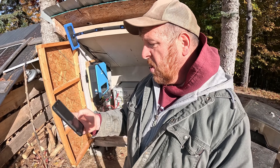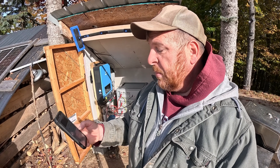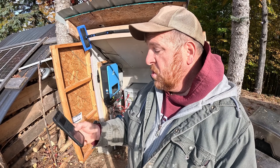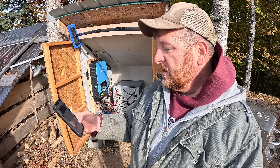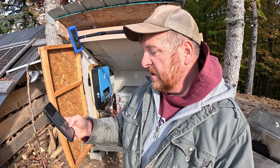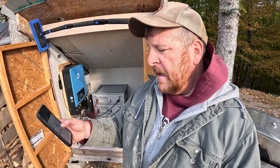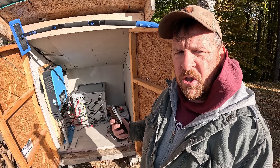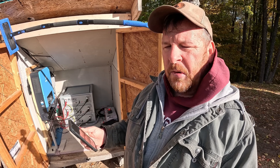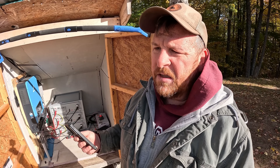I'm going to go on the solar app right now — Solar Man Smart. We're producing 1.46 kilowatts right now. We've produced 0.7 kilowatts because it's only been sunny for about a half hour. We've used 2.1 kilowatts today. I don't think I have the times set up correctly, so it resets in the middle of the night. The app is showing 1.46 kilowatts coming in — 184 watts going right to the cabin, and the remainder, 1.16 kilowatts, is going to the battery. So we're charging the batteries at about 1 kilowatt per hour. In theory it would take 15 hours to charge these up, but the sun just started and it will get better as the sun gets more in front of the panels.